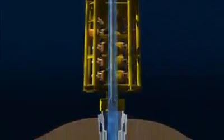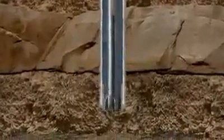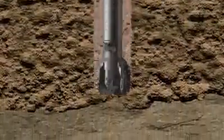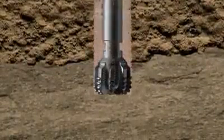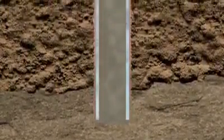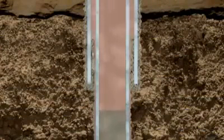From this point onwards, the drilling procedures are similar to those used to drill an onshore well. With the riser in place, seawater is replaced by a special fluid known as drilling mud that is pumped down the string and exits through ports in the bit. The mud not only cools the bit, but also clears the cuttings from the hole. The cuttings are captured at surface and examined by geologists to characterize the rock types being penetrated. As drilling continues, sets of decreasing diameter bits and casing runs are used as the well penetrates deeper into the rock. Each run of casing is cemented in place to provide integrity, a sealed system from top to bottom.